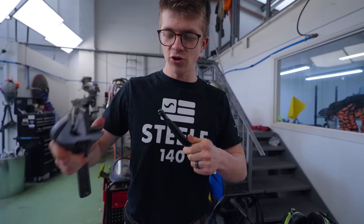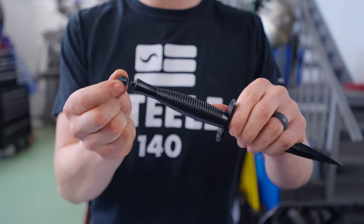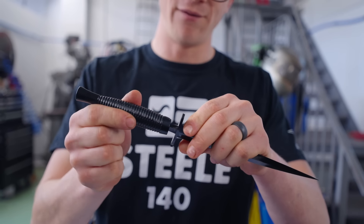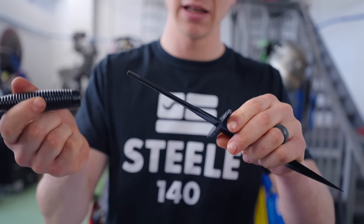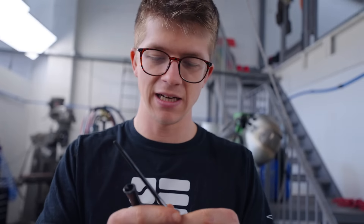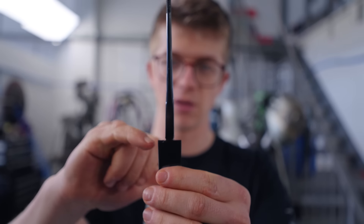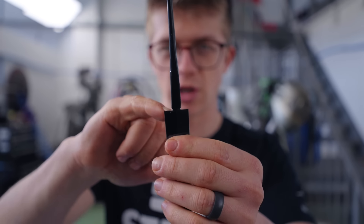It's definitely strong enough. It's constructed with this conical nut with a little conical hole in there so it all lines up. It's actually got very loose tolerances, which makes manufacturing a little bit easier. It's quite incredible that it's so strong despite the tang being so thin with that tiny little area for a potential stress concentration.